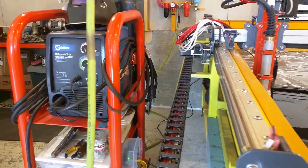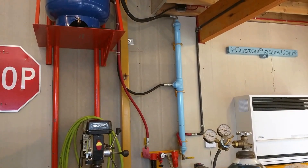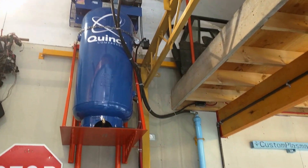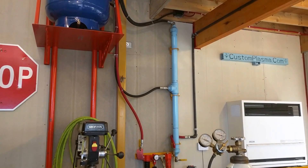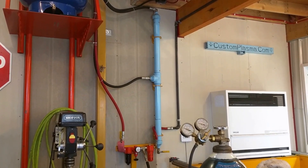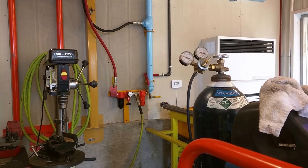The air itself needs to be really clean. There is a dryer unit in the blue vertical column, and that blue vertical column collects the compressed air directly off the compressor. It allows an initial charge of water to condense out of the flowing air stream and drop to the bottom at the lower yellow valve, just to the right of the regulators.